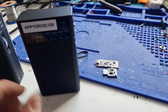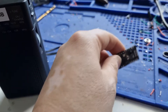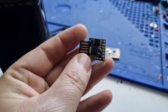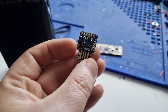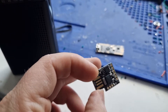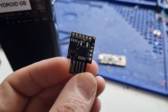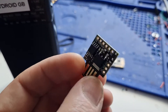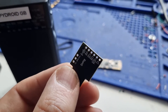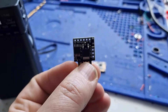I've recently just updated the sweep circuit on here. I used to use Arduino Nanos, but this is a new one I'm doing which is an ATtiny85 based chip. It does everything needed, it's also quieter — these bigger boards tend to have a little bit more noise on them. These are super quiet, you don't actually hear any of the buzzing sound which is inherent with PWM signals. It's also like the size of a postage stamp — it's tiny.